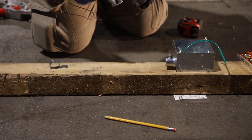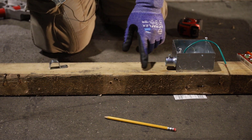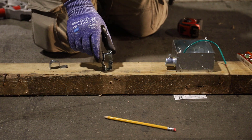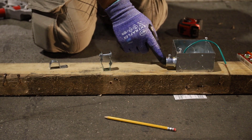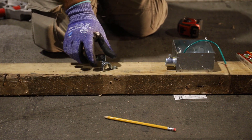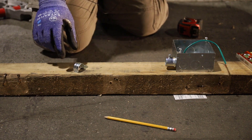This example is when we're not using one of these minis. A mini gives us the distance a half inch off the plane, so we don't need a box offset to get the conduit from the box connector to the plane. In this case we're going to be using a one-hole strap, which straps right back to the wall or the surface you're dealing with.